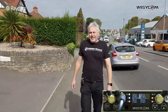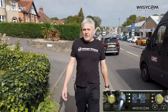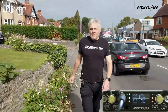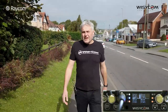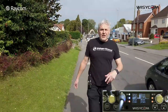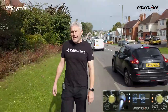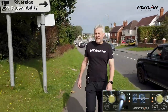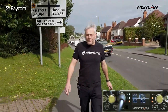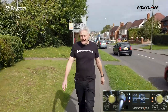At some point in the future it's almost a given that television is going to move off UHF. Bearing in mind that PMSE is a secondary user, that effectively means PMSE will have nowhere to go if there wasn't DME. This really is an opportunity to future-proof. I've been on sites for major television shows where you've got lots of lighting, LED walls, video screens, and SDI video all causing terrible interference to UHF - and literally when you get up to DME there's absolutely nothing. The noise floor is just thermal noise.